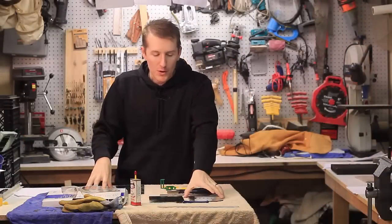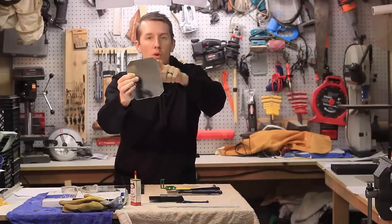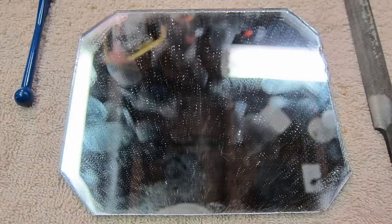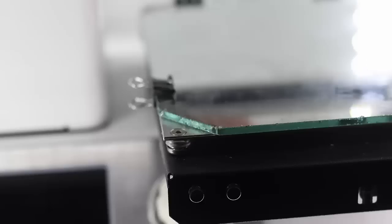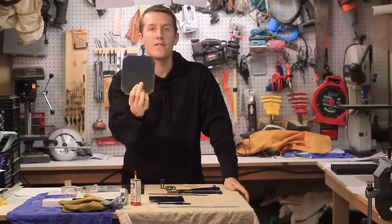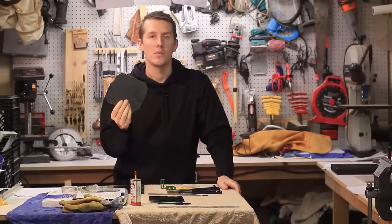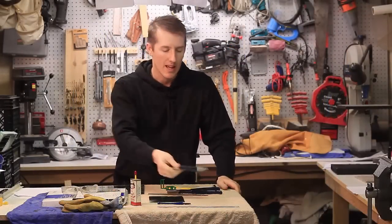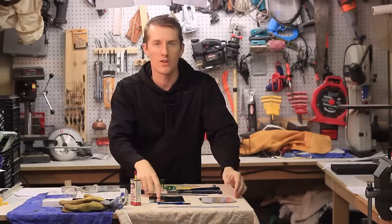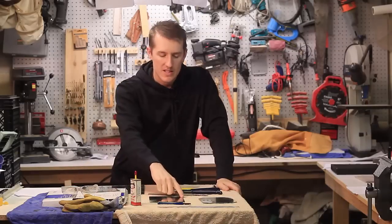What I came up with is cutting your glass five and a quarter by six and a quarter, then knocking off the corners with a glass cutter — score them and snap them off — and use a metal file to round everything over so it's not sharp. Now you have the full build plate area except for those adjustment screw corners. You can clamp it in and don't have to constantly move it. I have a few already made but I'll show you how I cut the corners.